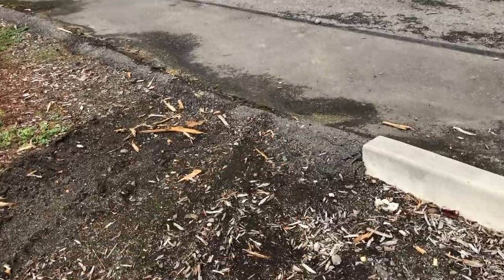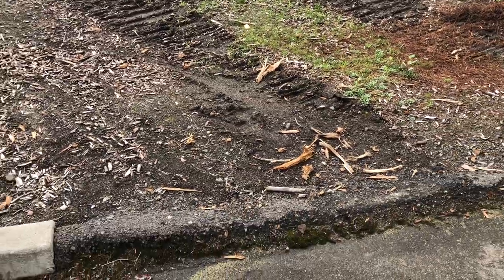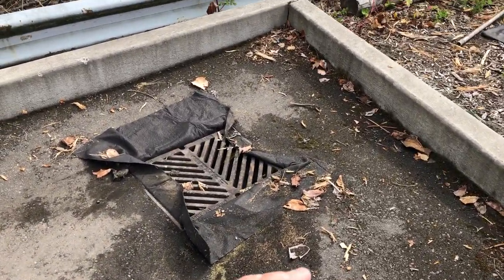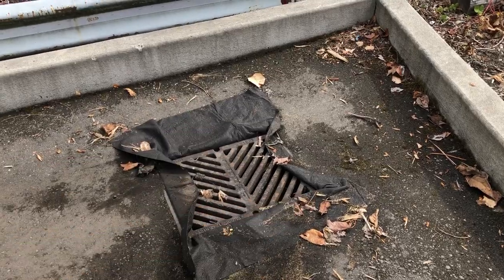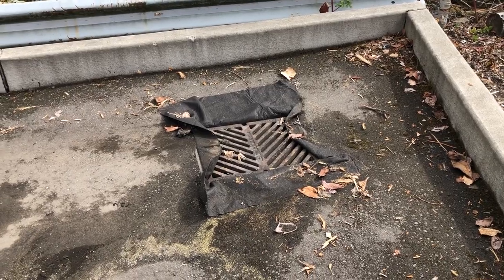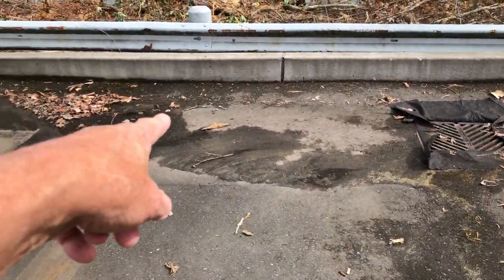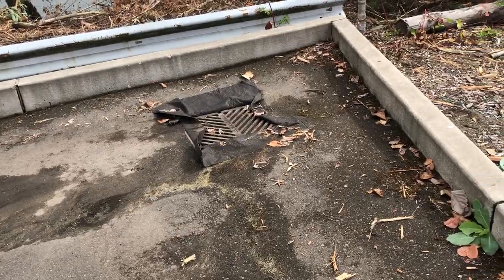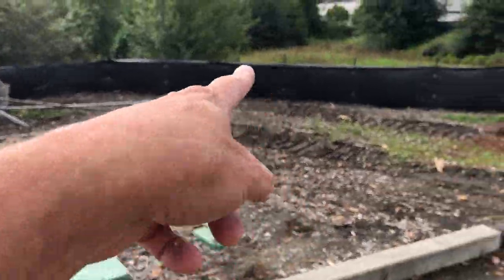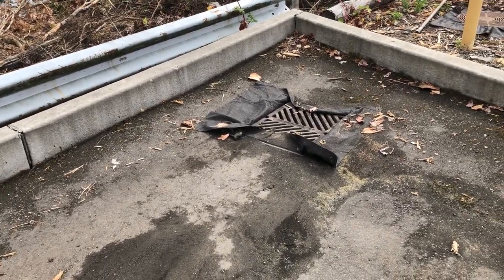As long as they're only coming in here, that's fine. But if they go out, they're going to have track-out, so that road needs to get put in pretty quickly. I wrote the erosion plan to have them put 30 mil PVC under the grate to completely seal that catch basin, and then set up a sump pump in this corner where the water's going to back up. They could put sandbags over here and create a sump area. Both of these catch basins drain into the swale over here, so these have to be bulletproof. I'll put a link to the erosion plan.